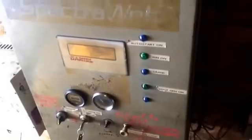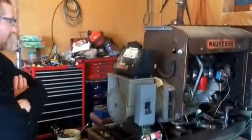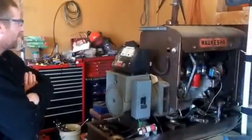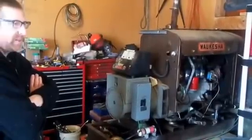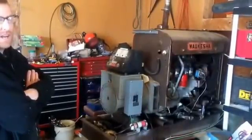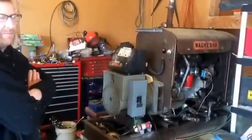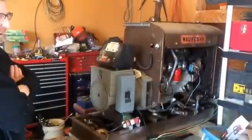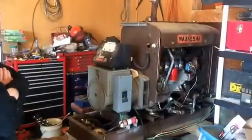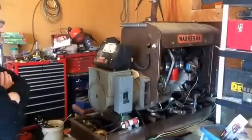We're going to take you now to where we have the generator. This is an old Waukesha generator — four-cylinder natural gas. I used to operate it 20 years ago when I was in another place. It burns about the same amount of gas as a 100,000 BTU furnace, but it does everything we need to do. It can charge batteries and run the house, and it will last about 25,000 hours if we keep the oil up and look after it. Parts are expensive, but it was worth every penny. This runs pretty much all the time in the wintertime because we don't have enough sunlight hours to charge the solar panels.